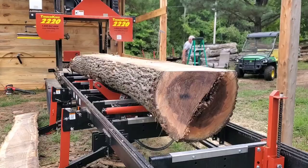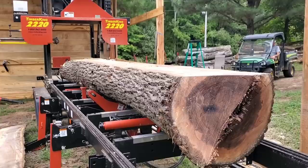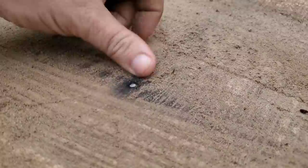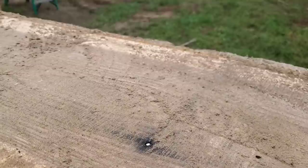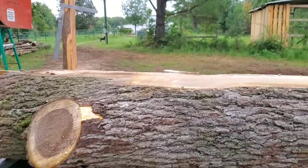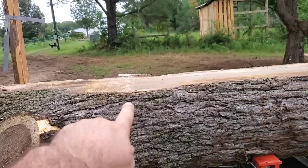Okay folks, so we are learning a lot with what just happened. There's a few things that did happen - it was not the best cut. We don't know if this is something in the way that we sharpened this, if there's some kind of weird technique you have to use while sharpening. We also did hit a nail - we didn't even realize we hit the nail, but as you can see we've got a pretty clean 16 penny cut right there. We're going to go ahead and see if we can pull out the nail section on the other piece of wood that came off here to see how much nail we have and determine - do we continue with the next cut? Let me show you what happened. First thing - see that right there? We have a divot - a nice divot right there. Entering into the log we had a little bit of movement and right here after this knot section it did dip down.